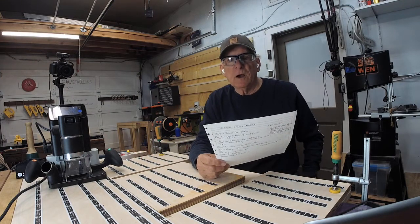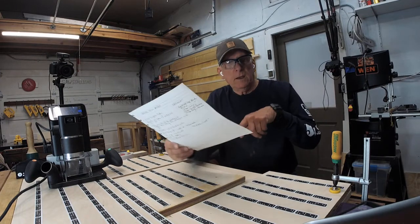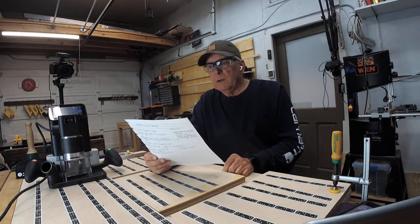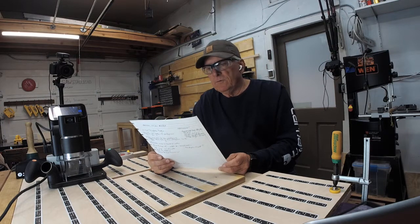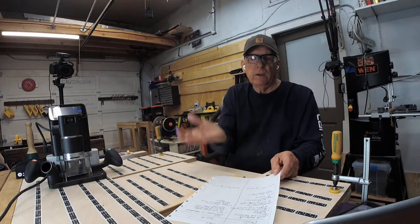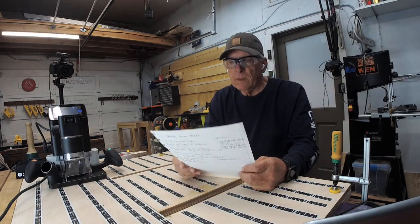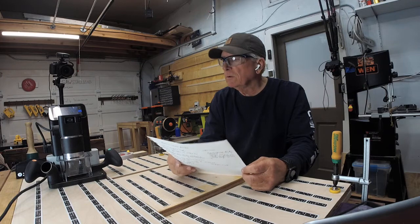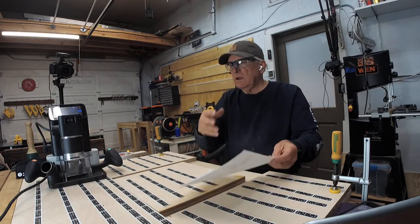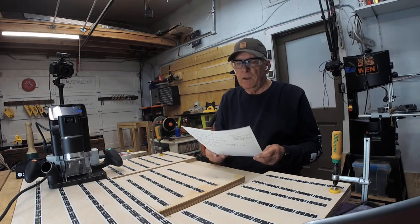But again, the biggest con, and I think there's a 3/4 inch limit on how far it can plunge. And so that certainly could be a big limitation compared to a dedicated CNC. I'm sure a regular CNC has much, much more depth control, where it can plunge. So anyway, maybe the 3/4 inch will turn out to be a problem. Some of the videos I've seen on it are just fantastic as far as what people are creating by using it. So it certainly has its place.